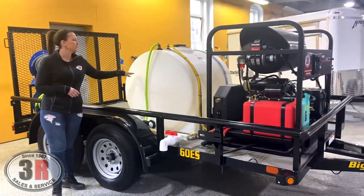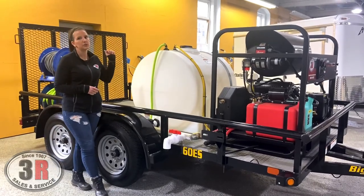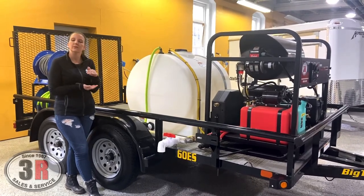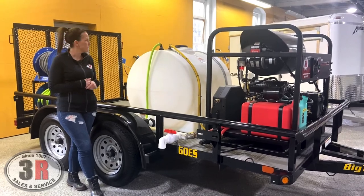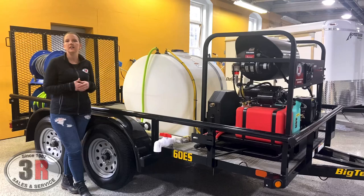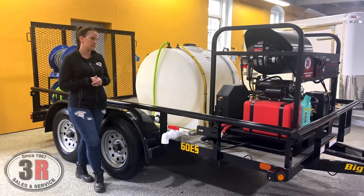This is the 225-gallon tank. We've got it set up off of the incoming hose reel. There's a float valve inside, so that'll shut off your water flow when the tank is full and then automatically start filling once you pull water from it again. This yellow hose here is the cool bypass line — as soon as you let off the trigger on the pressure washer, it's automatically going to circulate the water in your tank so you don't overheat your pump.